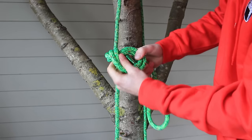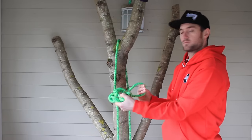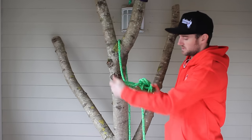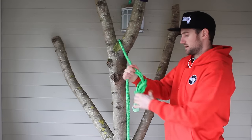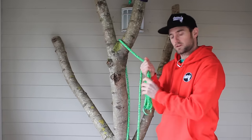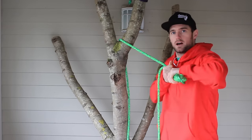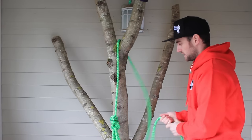...take the anchor ring and poke that up through the hole. Then with the bite, instead of passing it all the way through, take the bite over the hole of the knot past everything, and then you can set and dress your knot. There you've got the double figure of eight, which is a really common knot used in industrial rope access — really strong and multi-directional, so perfect for this configuration.